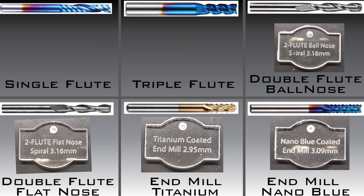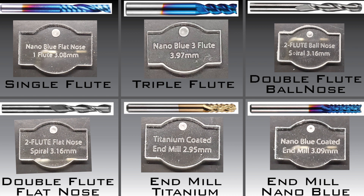How did the single and triple flute fare? They both ejected way larger pieces of acrylic than the other four bits, and also ejected further away from my machine. The big difference is that the single and triple had tiny to no artifacts left around the edges, so a very light sanding is needed to polish the edge as opposed to getting rid of material. As for noise level, it seemed the normal end bits were louder than the other four after the initial first layer was cut, but when watching the video playback they both seemed to be about the same, so the jury is still out on that question.